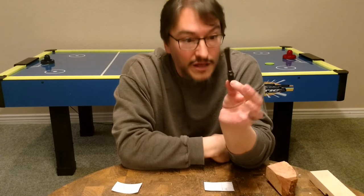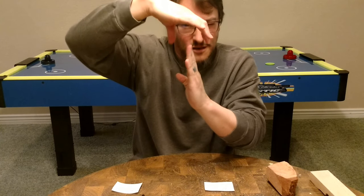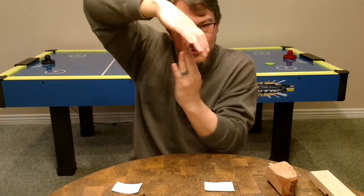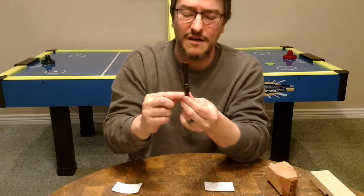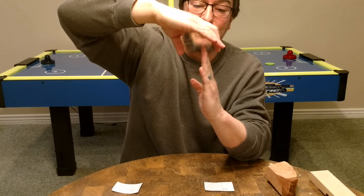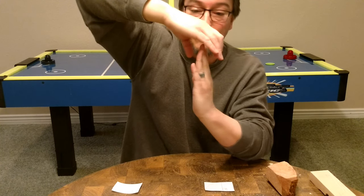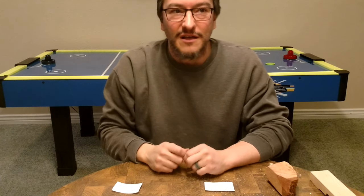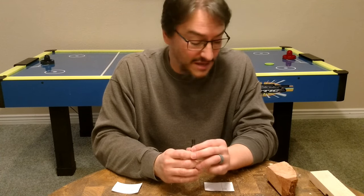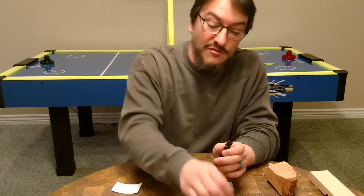That's fine as long as you only have one fit hole to drill into the pipe. But as soon as you get two of them, you have to be able to rotate the stem — otherwise you can't get it out. If it's severely off-center, you need a bigger hole. These stems are also not really round; this one's worse than the other. It's kind of squarish, clearly made in two halves from a clamshell mold, and the clamshell didn't quite line up on this one.